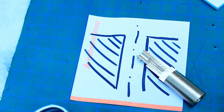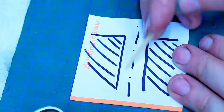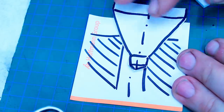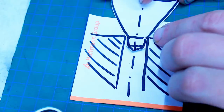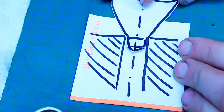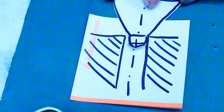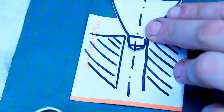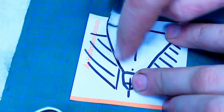A little addition to the 60 degree feature that we did here on the inside. We started by drilling undersize and then to size. This is the final diameter of the through hole. Then I took my 60 degree center drill and I came in here until the edge of the cone of this center drill touched this edge here. I zeroed out the DRO in this position, repeated it, checked if it's repeatable or if there is anything weird happening, but it repeated within 10 microns when I did this. Zeroed out the DRO and then I used my calculated depth, the correct one, to cut in to my final depth.